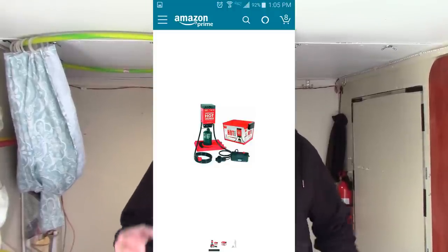We tried the Zody shower — the kind that you put on top of a burner of a stove. Some of them have a stove built into them, and they pump the water through a copper coil with an electric pump that goes in a bucket of water, and then it goes to your shower. It's kind of handy, except that if you stop using the water and then go to use it again, it blasts you with boiling hot water. So you've got to run that out.